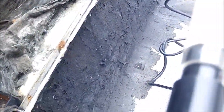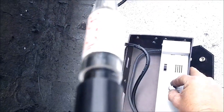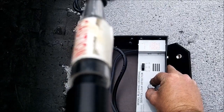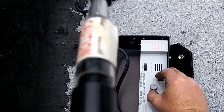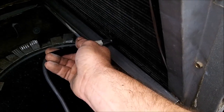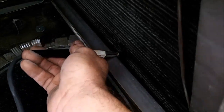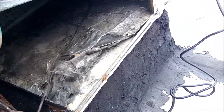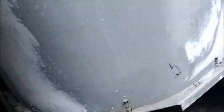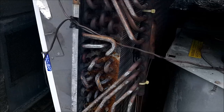I had it turned down a little too much, so I reset it. Now I'll get in here. As you can see, this 1994 unit has a leak on the evaporator and that's why it was low on Freon.